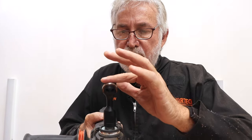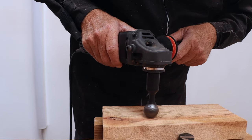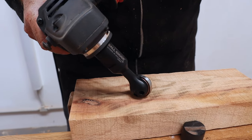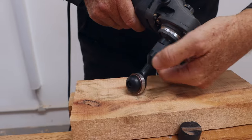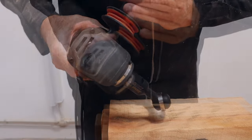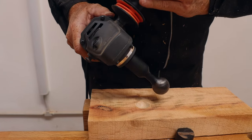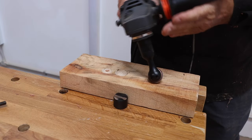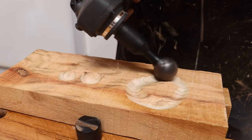There's no cutting edge at the top point, which allows it to be steadied on the wood and stops it from jumping around — so it's very steady on that edge. But it will not plunge straight down; you need to lean it over slightly. Always lean it to the right. Do not lean it the other direction, because the blade will pull towards you. If you lean it this direction, it always pulls away from you and it's very safe and easy to use. With this tool I always use it at a slight angle and move it around for different cuts — you can literally do any shape, you can even write your name with it.